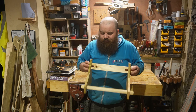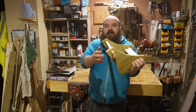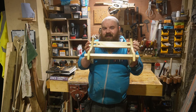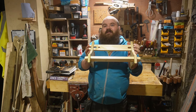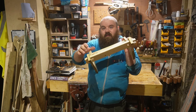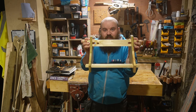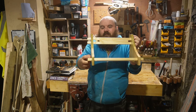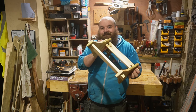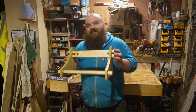And you know, the breakage here on the short grain, part of that is because I'm too close here, but I think I can develop this to work better and to work in those conditions if we just maybe bevel inside of the mortise a bit and increase the shoulder here, because it's the tension of the side being pulled together that's holding it. So if we reduce the amount of friction and space here, I think we can get a really, really strong joint.